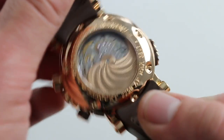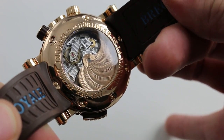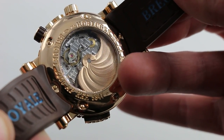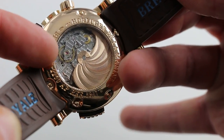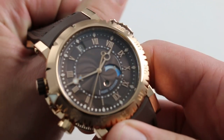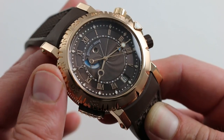On the case back you can see the Breguet caliber 519R. It's finished to a different standard than Blancpain GMT Reveil watches that feature the same base caliber — somewhat simplified and, I would say, beautified. There's a gorgeous rose lathe — not quite Clou de Paris, but a guilloché swirl reminiscent of nautical imagery on the 18-karat gold winding mass — and gorgeous linear Côte de Genève across the movement itself. The base plate perlage is very tight and evenly overlaid, beautifully executed, with glowing edges on the bridges featuring hand-laid rounded anglage. The watch also features a free-sprung balance — appropriate for a sports watch — offering the more durable free-sprung architecture rather than a mobile stud. Tough, massively built, beautifully finished, and mechanically complex: this is an incredible timepiece.